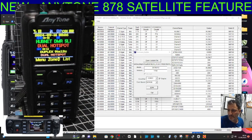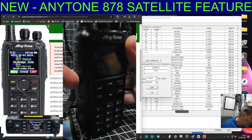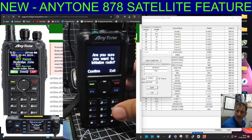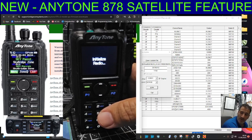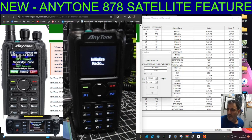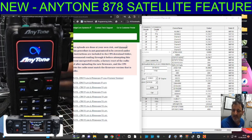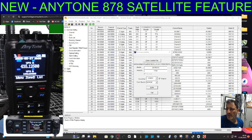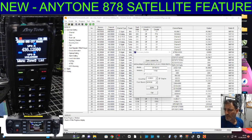The firmware is in. Now for the factory reset: turn off the radio, press PTT and the button underneath - it's quite fiddly - hold them in and turn on. You'll get the option to factory reset. Confirm it, and it will ask for the time - I won't set that now. Once that's done we're going to reload our code plug. The radio now looks very blank, so back to the software.